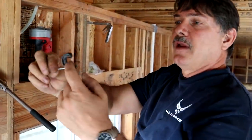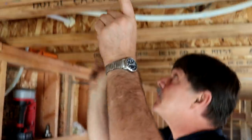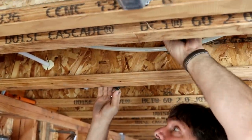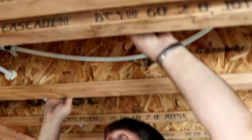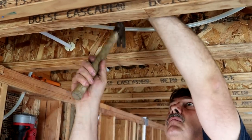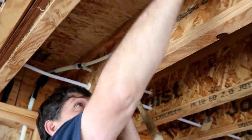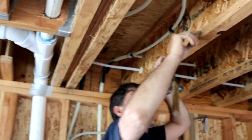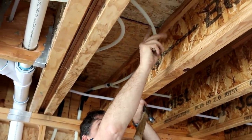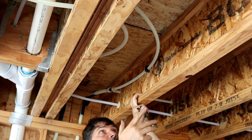These little guys fit half and three-quarter inch pipe, and they're nail-ons. They're where you need to clamp the pipe every 32 inches, and that's the code here. I don't know what your particular code is. It's nice to keep these bends long and sweeping, generous and relaxed. If you happen to kink this pipe real hard, you can warm it up with a heat gun. It'll turn clear and then go back the way it was made.